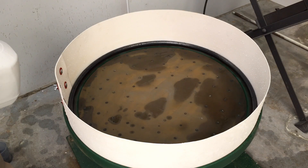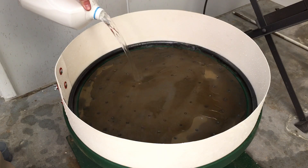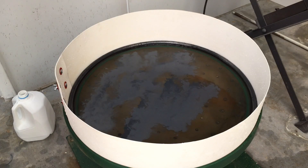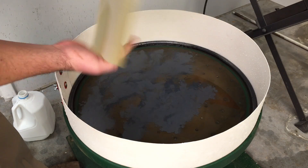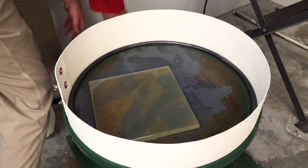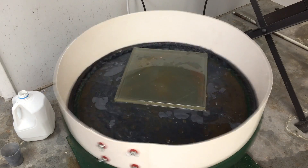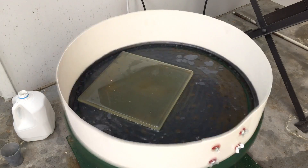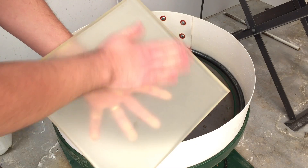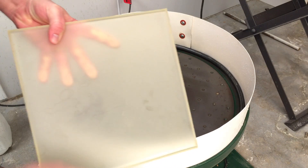Now we've cleaned it out. It's been sitting for a little bit so it's developing some rust — and as I said before, rust is not a big deal; it is not going to affect your glass. We're going to put some water in and fill the pan. Now I'm skipping over to a 220 grit. Here's our piece that we have ground with our 60, and now we're going to go in with our 220 and let this go for a while. After two different steps in the Reciprolap — a 60 grit for the rough grind and then a 220 grit to get a nice surface — it's looking really, really nice. Reciprolaps are fantastic for skipping large steps and being able to get down to a very nice surface very quickly.